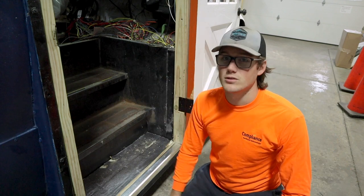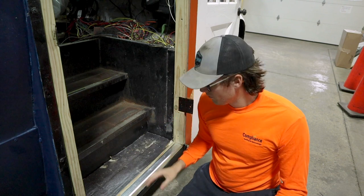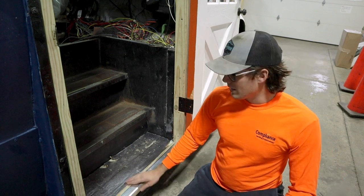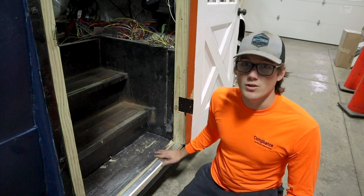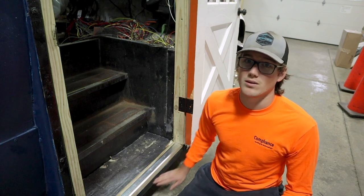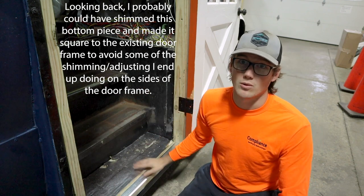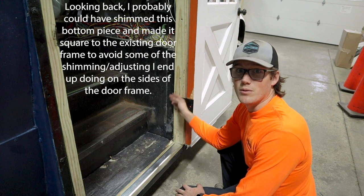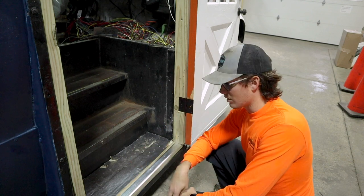So where do you start when building a door frame you've never built before? All the wood I used was pressure treated. I used two by fours and ripped them down to about three inches wide to fit in the existing door frame. I started at the bottom — I knew I'd be putting a two by four piece there to give us a nice threshold, also covering some old bolt holes. Since I couldn't trust the bus frame was level, I wanted to create my own square frame within the door opening, making a perfectly square corner to work from.